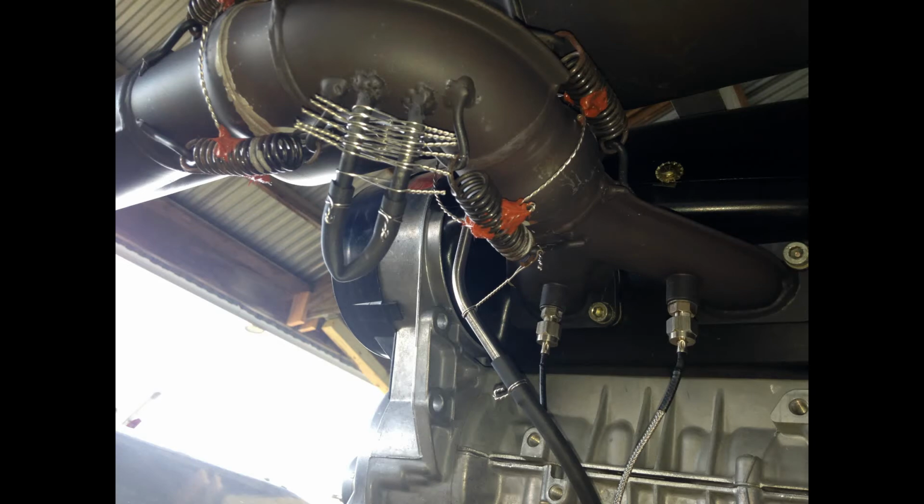But there's a danger to this in that if the pressure wave returns too soon, it not only shoves the raw, unburnt, ordinarily wasted fuel back into the cylinder, but it can overdo it and bring hot exhaust gas back into the cylinder, and it can actually burn your piston near the exhaust port. And this is an aircraft engine we're talking about. My life depends on it, so I realized that I needed to change that situation.